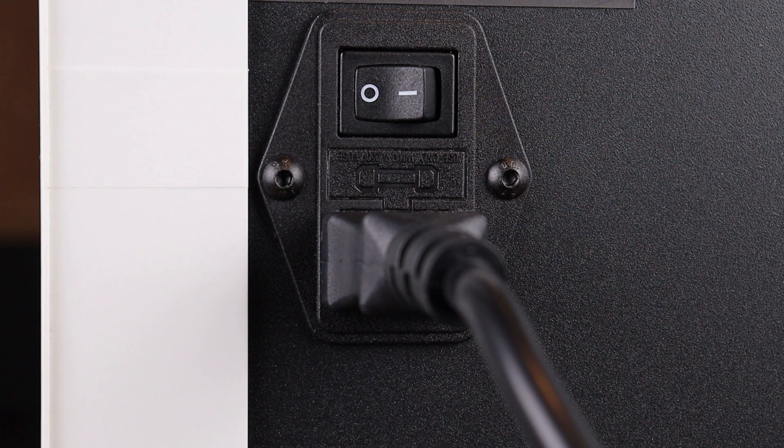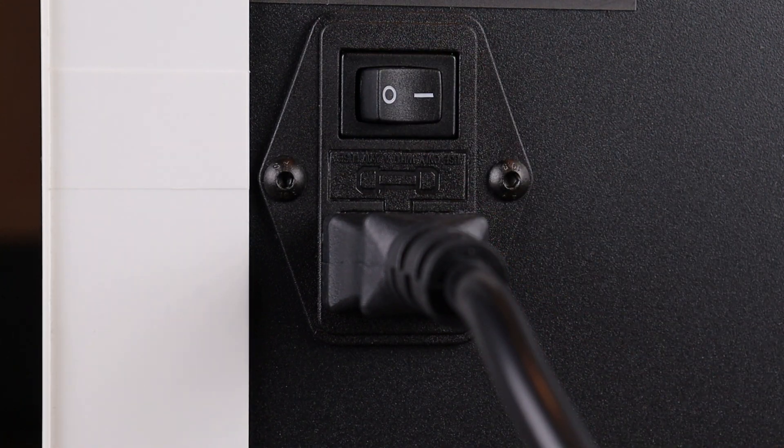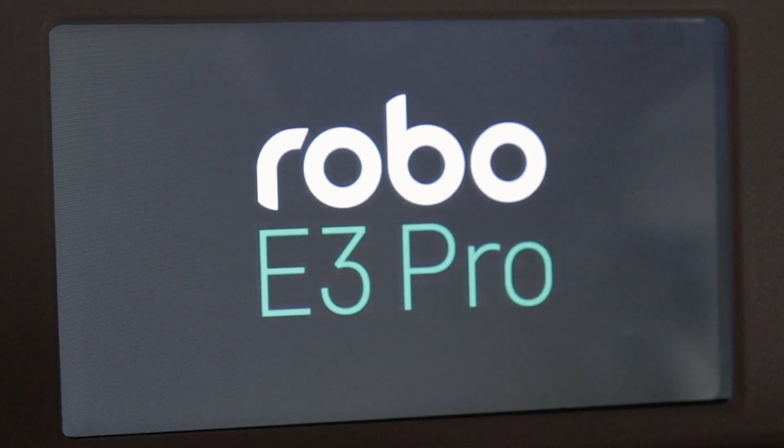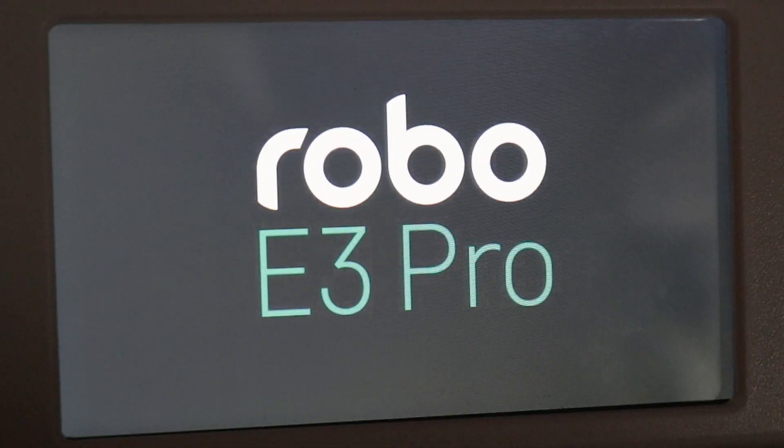Okay, let's get making. Plug the power adapter into the port at the back of the machine, then into the wall, and turn the 3D printer on using the switch at the back. While the touchscreen loads, take a look at the reel of filament feeding into the machine. If the filament is what you'd like to use, you can skip the next step, but if you'd like a different color or the reel looks too low on plastic, you'll need to unload the current reel and load a new one.